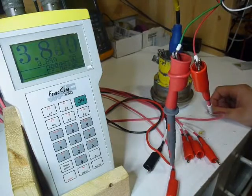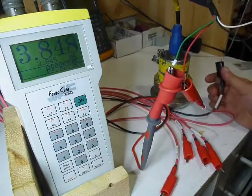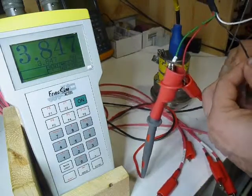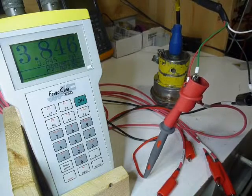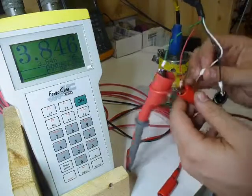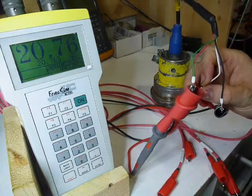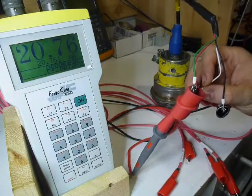At full scale, if you remember, the pinout that I'm familiar with is that C also has to be tied to ground. So I'm going to tie C to ground. And if you take D and apply 24 volts to that, it should do that shunt full scale calibration. So I'm going to find my 24 volt lead right there, touch that to there, and it'll do the top end there. So obviously you can see this transducer is a little bit out of calibration.